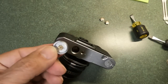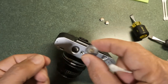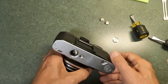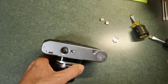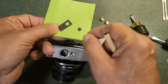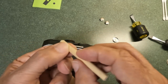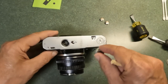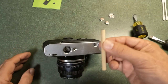In some cases you may find the springs are pitted or damaged. Also check the inside of the cap — this one looks a little dirty and may need some cleaning. You want good contacts on both sides. Try cleaning with your cotton bud and a little vinegar. If it's still not looking shiny, I've made another tool: I take a dowel, some 800-grit sandpaper, and a hole punch to punch out little circles, then glue the sandpaper to the end of the dowel. That lets me get in and clean the contact points on the battery compartment.